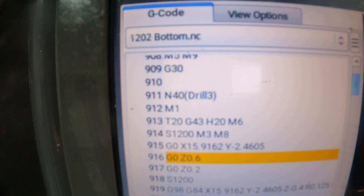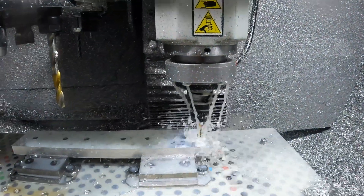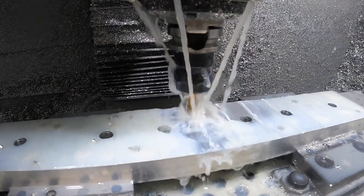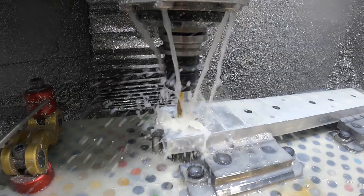Here's the tap: 1200 RPMs, feeding at 59 inches per minute — that's what the math comes out to at 1200 for an M8 tap. Check it out. 1200 seems to be a nice recipe for 75% thread engagement form tapping in aluminum on the 1100 MX.